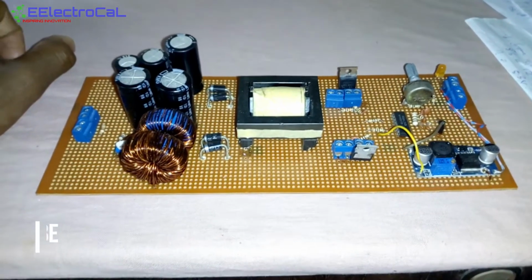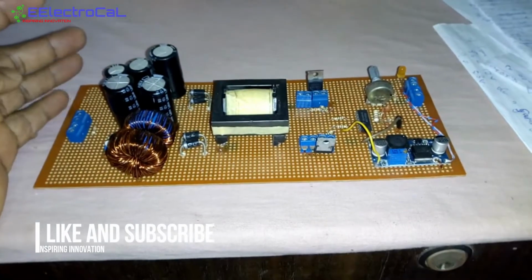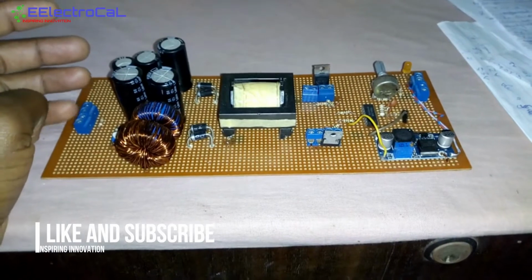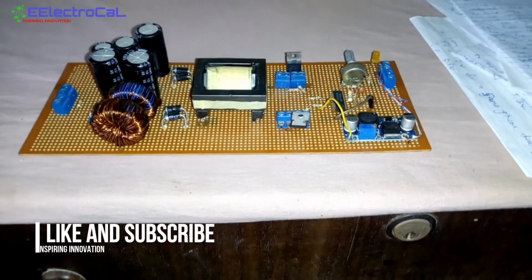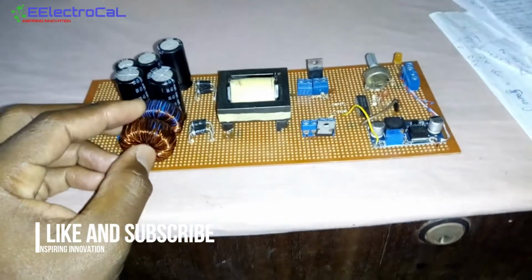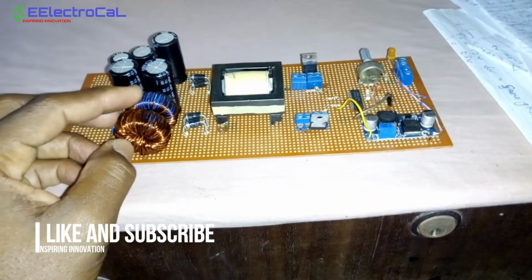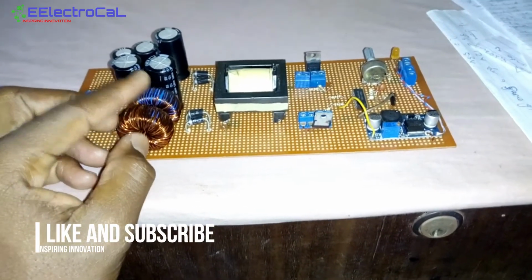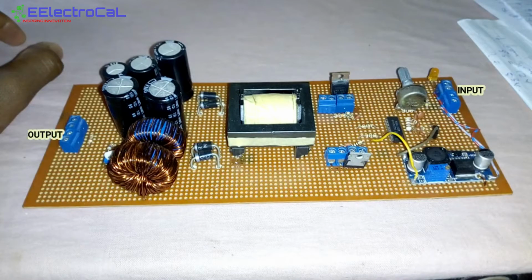Today we're looking at some of the design specifications we considered in designing our switch mode power supply. As you can see on the screen, we have our circuit already put together there. So I'll be taking you through the components we used and the design criteria we considered when putting them together. On the screen we have our DC to DC buck converter, which steps down the supply voltage down to about 12 volts.